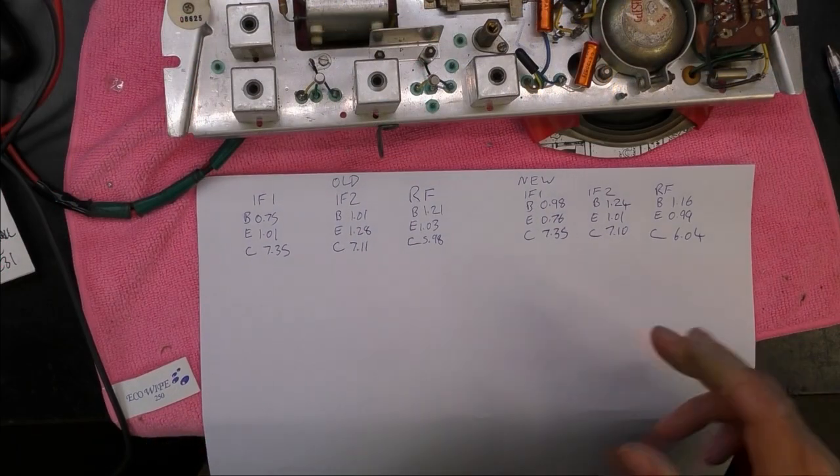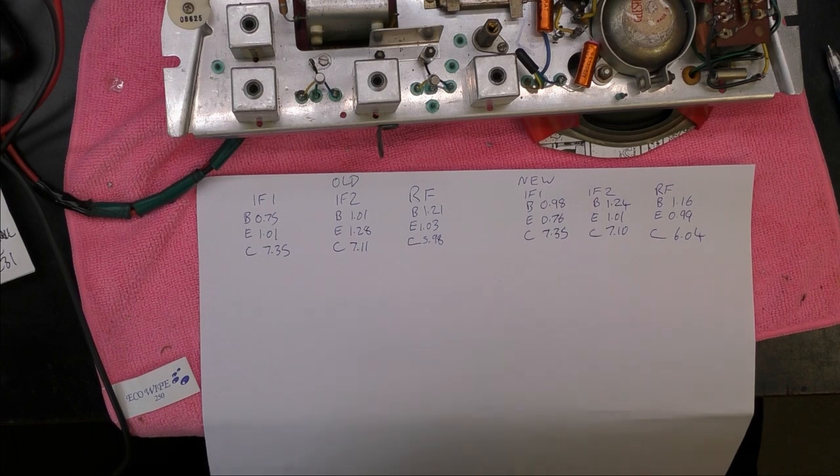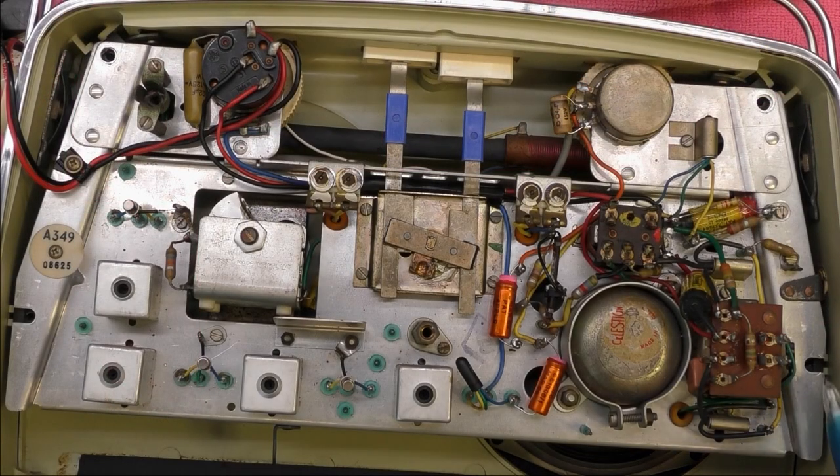Here are the voltages measured on the RF transistors since I changed them. There is some difference in the base voltage, but overall the collector voltages are pretty similar - I'd expect that because there isn't a lot of resistance in the collector. The sensitivity still seems good; it's pulling in Radio Caroline very well. The AGC voltage looks fairly similar, so I think that's probably a success replacing those transistors. Just putting the radio back in - I can see there's a gap between the chassis and the mounting bolt, so the speaker is a little bit too far out. I just have to loosen that a little bit before I tighten up.